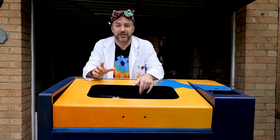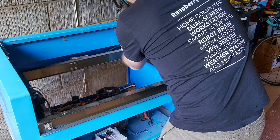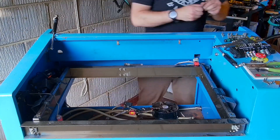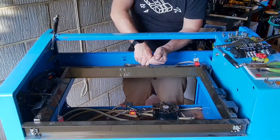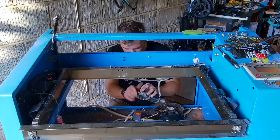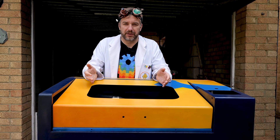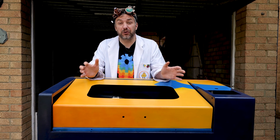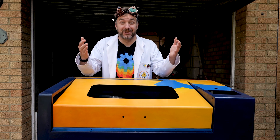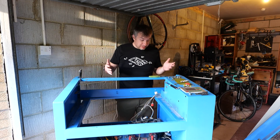I mentioned I'd do two things differently. The first: I discovered there's an additional section at the back of the machine — a small panel with four screws. Once you remove it, it gives you full access to the gantry, which is only mounted with four screws. Once you can access them you can simply remove them and pull out the gantry as one piece, which is great because in my next video I'm going to focus on rebuilding the gantry on the workbench and then just slot it back into the enclosure.